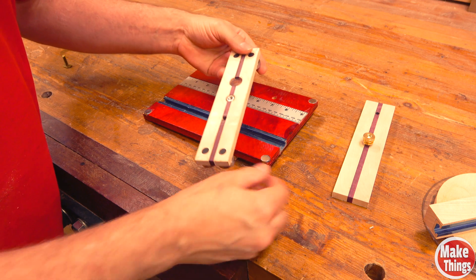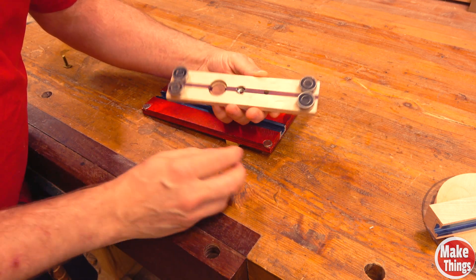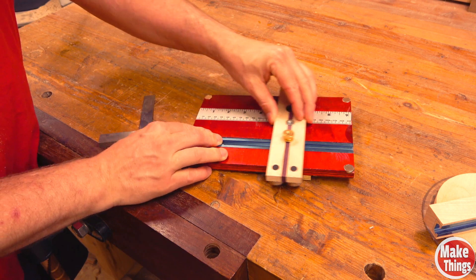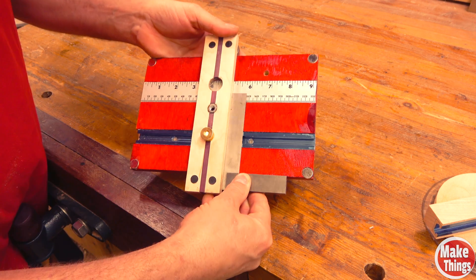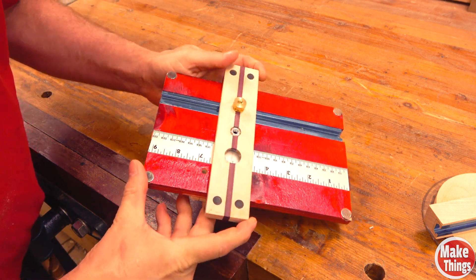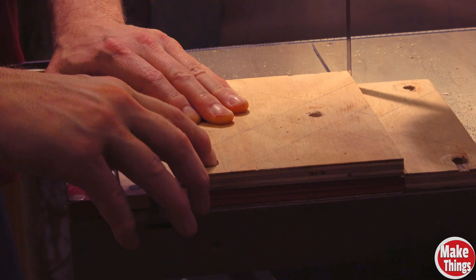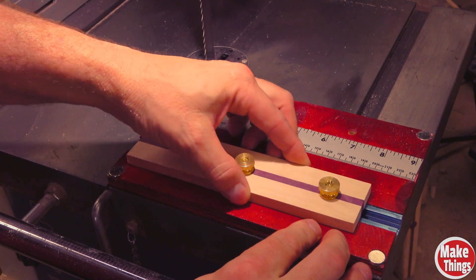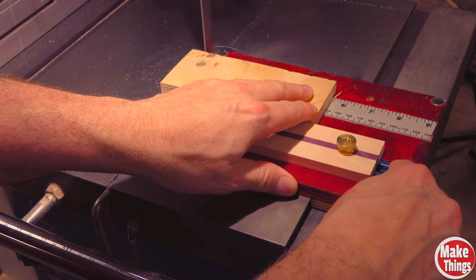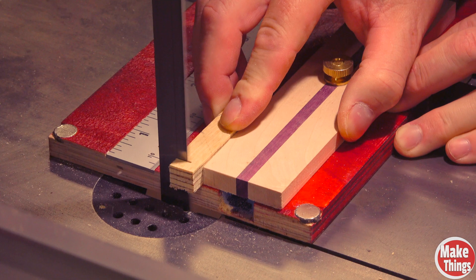I made both a vertical and horizontal miter arm. The vertical miter arm has bearings on both the front and back side that keeps it perpendicular to the front, giving us a perfect 90 degree angle — it simply follows the front and back side of the base. The horizontal miter arm acts just like a miter gauge but gets me right next to the blade, making miter cuts easy and, unlike the table saw, doesn't give me kickback.